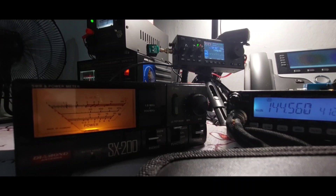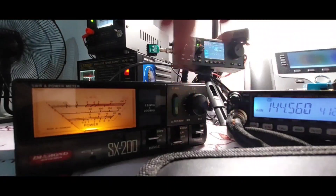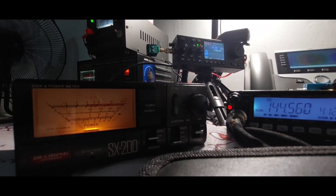Now we're going to set to mid 1, which is supposed to be 25 watts. Let's check the SWR first. Fox 2 stroke November 7 Sierra India X-ray transmitting at mid 1 power — SWR is 1.3. Now let's check the power, setting range to 200 watts. I assume it's 25 watts.